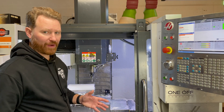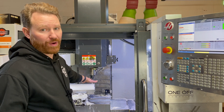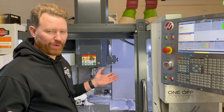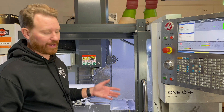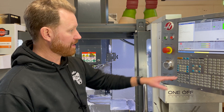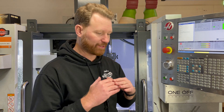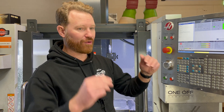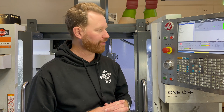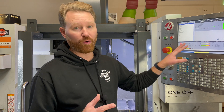At the end of our program, it's going to come down and measure our bore to tell us whether we're in or out of tolerance — we've got about 5 thousandths plus or minus. This came up with 0.782, so we're 2 thousandths over. That's perfectly acceptable for plastic. And if we told the probe to go a little deeper, it would probably be closer than we think.